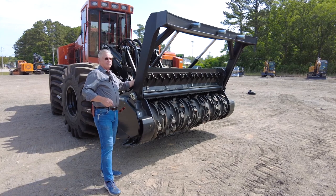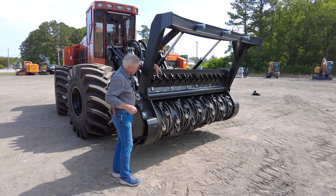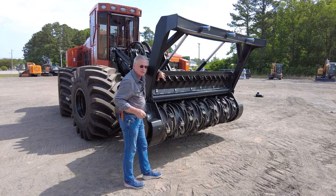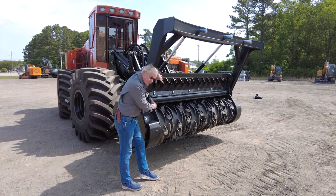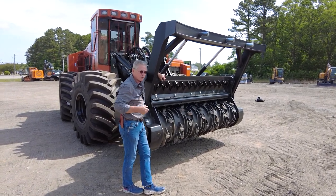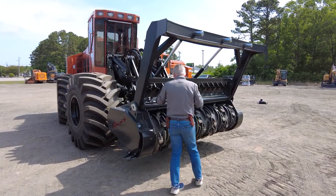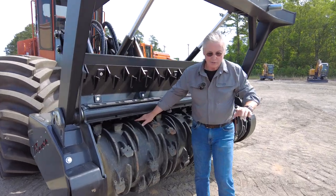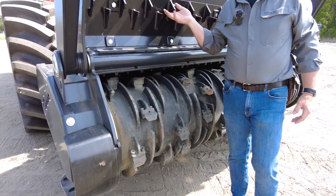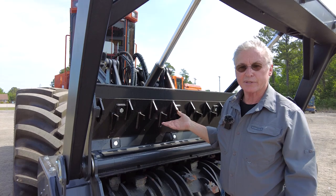The door flap is a much heavier metal and heavier design than the originals. We've got AR400 wear steel as the wear plates and wear liners, all the way through behind the rotor through the housing. They're bolted in instead of welded in, so you can actually change them without having to take a torch out. They all have counter cutters on them. The purpose of the counter cutters is to keep processing the material — pulling it through and mulching it up in a finer manner, quicker and faster, on one pass instead of two or three passes to get the final product.